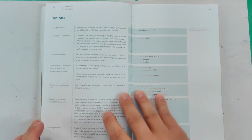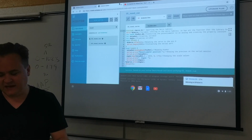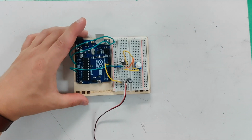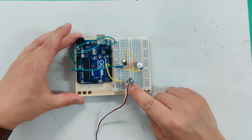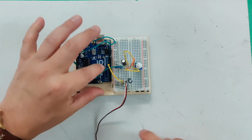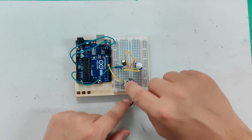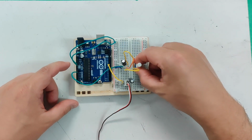The biggest thing I would say, though, is be careful with the wiring. This is a tricky one. Take your time. Look at all the hacks. I'm just going to leave this here for you to look at, right? I've modified this. I've flipped these, and I had to extend the power wire one over from the original diagram, and I changed where pin 9 was connecting to because of how this was wired differently than in the book. And I jumped everything over for the potentiometer.